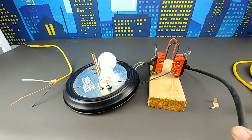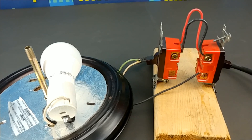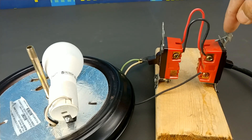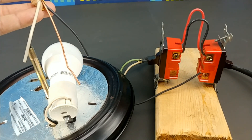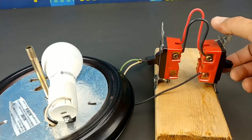As you can see here, this extension cord is representing my 12-2. It comes up and goes to the bottom screw of the first switch. My 12-3 goes from the top two screws of this first light switch over to the second switch. And then from that second switch, my 12-2 goes out the bottom and over to my light, which gives me my three-way operation. On that note, let me end by saying thank you for coming to Bevan's Builds. I hope this video was helpful and we'll see you next time on Bevan's Builds.